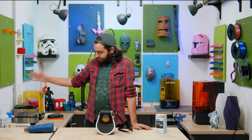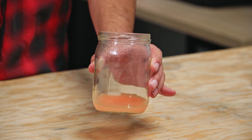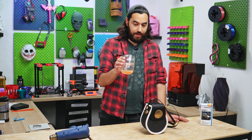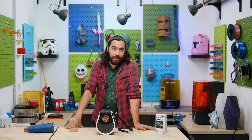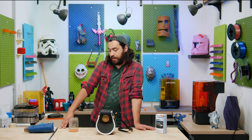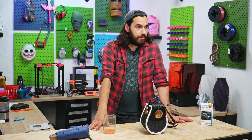Now, this has been done before. There was a startup in the Netherlands called Electro Loom who designed a 3D printer that can electro spin fabric. Unfortunately, commercially it didn't work, but they still made a pretty cool vest. And there are obviously such things as auto looms, but I really want to use filament or resin to do this. And I have actually started — this is nylon, liquid nylon, nylon dissolved in solvent. If you let the solvent evaporate, it will harden. This is sort of like acetone smoothing with ABS, but in the end I want to get fibers out of this and maybe combine 3D prints and fabric.